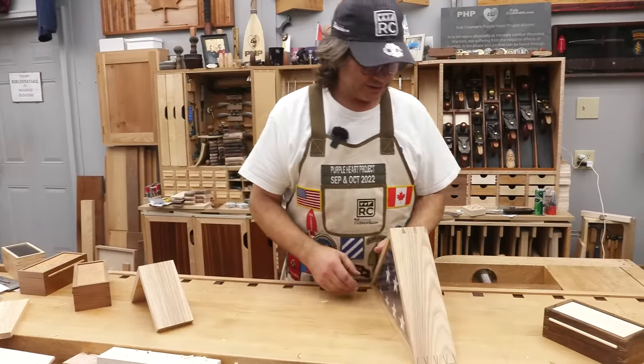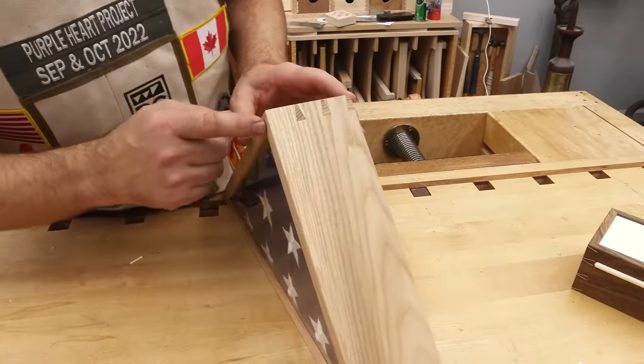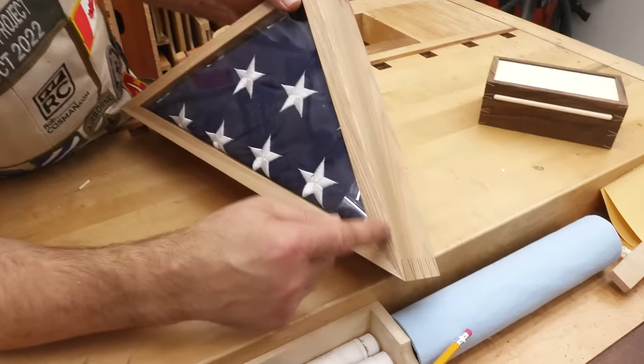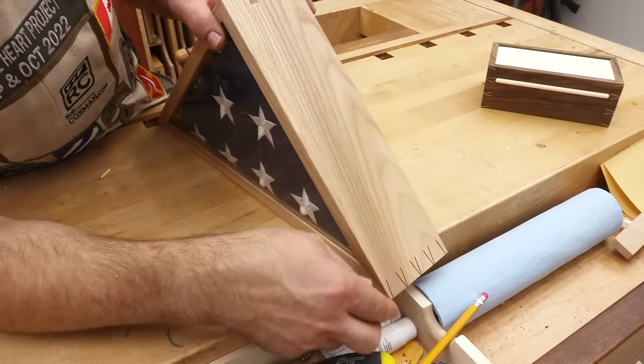If we take a closer look at this, it's got a 90-degree corner up here, and I can do a traditional dovetail — it's actually a through mitered edge dovetail — but down here, instead of a 90, you've got a 45. So trying to do a traditional dovetail here is almost impossible.